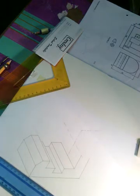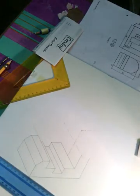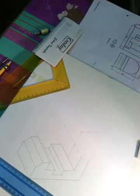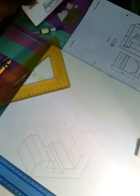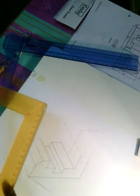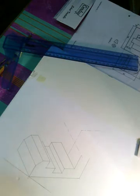Let's learn how to draw in isometric circles. We've got a square with corners one, two, three, four — this is the square. So we have center one, center two, center three, center four. Then from there, we have different types of methods, so we have to go for the easier and faster one, which is the four-center method.